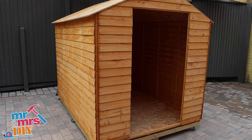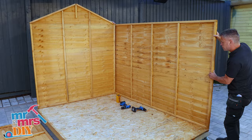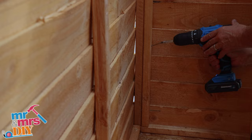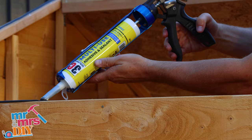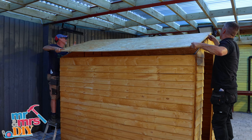Hi, I'm Craig Phillips. This is how you build a flat pack garden shed. Starting with the back — it's always wise to have somebody to hold it. Into the base first, then lift up the side panel, holding it square and level at the corner and driving some screws in to hold it into position. Then screw the bottom of the side panel into the base. Do the same with the opposite side panel, then place the front section in position, double check it's level, and screw it into the two side sections and the base. When driving the screws in it's always wise to drill a pilot hole first. Now the four sides are fixed, we're going to place the roof panels on — but first I'm running a line of multi-use adhesive all the way along the front, back and centre edges. Place the panel into position and screw it down. The glue adds to the overall structural strength. That's the main structure now complete.